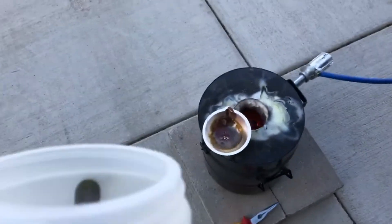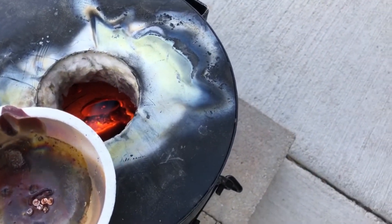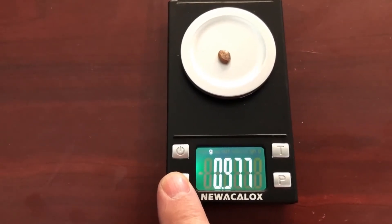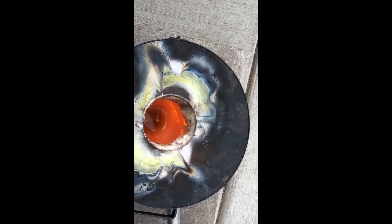Next, I fire up the furnace and put the contacts into a dish with some flux. The flux will pull some of the contaminants out of the silver and should remove the copper that was on the contacts. After smelting, the button weighs a little less than a gram, which was expected. I smelt it again, combining the button from the UPS relay and this button, for a total of about 1.4 grams of silver, worth about $1.15.